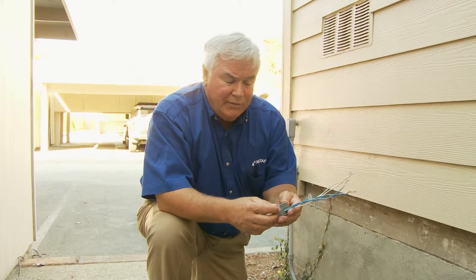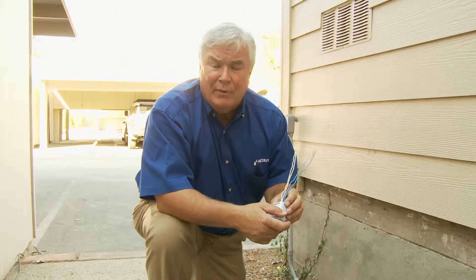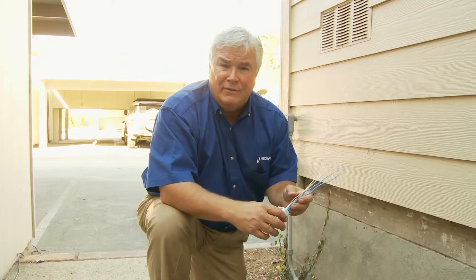I'm now going to show you how to wire a two-wire decoder into the Netafim two-wire NLCD controller. This is the decoder that has been pre-programmed at the controller — that is a must. These are not programmed on the two-wire path; they're programmed at the controller before you actually bring them out to the field.